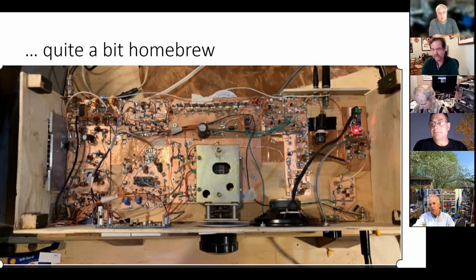The other thing you do here, from pin 1 to 8, sets the gain. And if you put a 10 microfarad cap across 1 to 8, that greatly increases the gain. If you remove the cap, it greatly reduces the gain of the LM386.